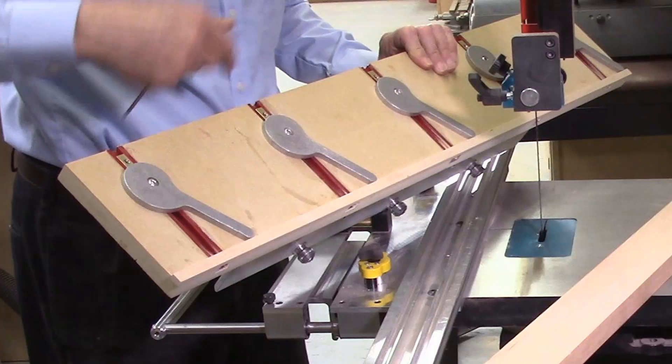There's one additional step which I lost the video on: I attached a piece of maple which is a quarter inch thick by three-eighths inch wide to the bottom of the fence. It was just glued on with Titebond II glue.